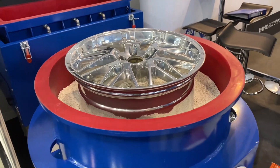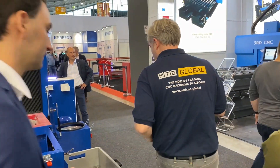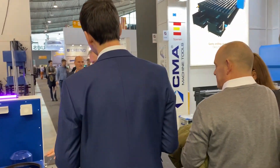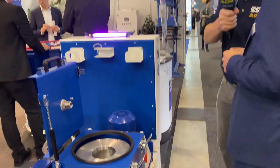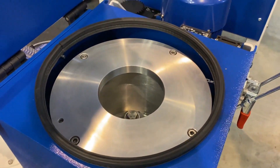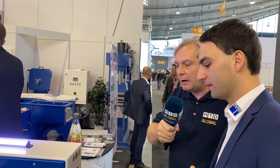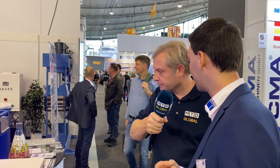It's not just about the rumblings — there's also a water treatment system. The water inside the machine has a lot of dirt in it, and if you want to recycle the water you need this centrifuge with lots of g-force to separate out the dust.